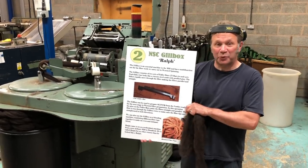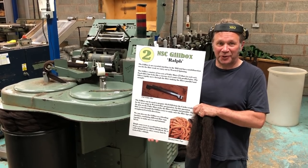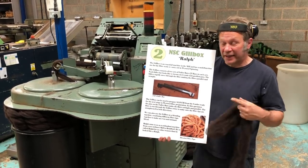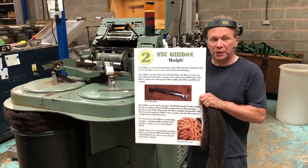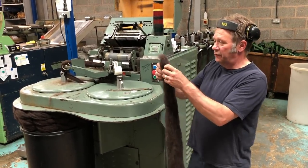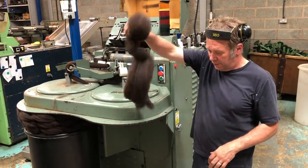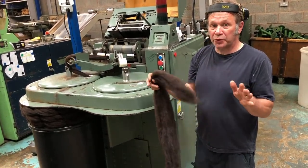Second stage of our worsted processing, and this is straight after carding. So we've carded our Zwartbles, which I've got here, into a sliver, and here's a board explaining that process. Again, there's a PDF of this. You go to the website, you download it, and it'll give you a little bit more detail about what's going on. Meantime, here's our sliver that we've done. Now the fibres are sitting in a fairly random orientation. It's full of vegetable matter, and if I give it a shake, bits do fall out. There's lots of short fibre in there, which we want to remove.